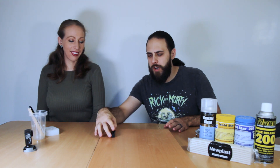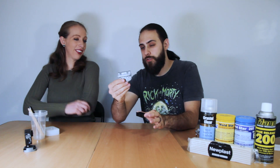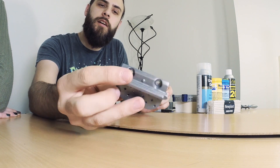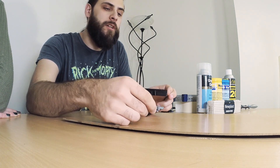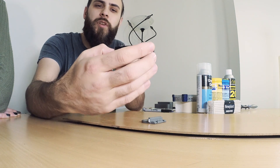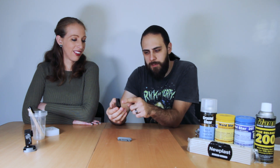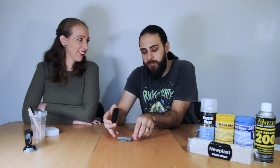We're going to do something similar today, except this time we're going to do it with a two-part mold. The concept of a two-part mold is when you've got an object that doesn't just have one important face, or it has undercuts. This part here is the second part of that clip - we cast this which is only really important on the top face, the back face is black and the front has a chrome effect. On this master, we're interested in the inside and the outside, but there's no good way to mold it as a single part - molding it one way gives an imperfect surface, and molding it the other way creates an undercut.